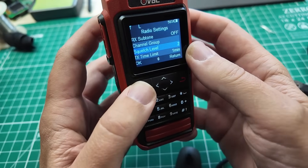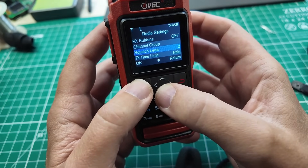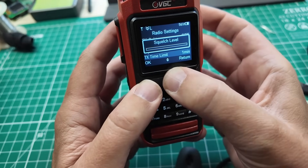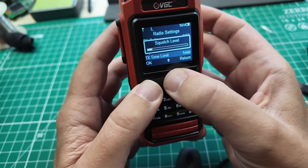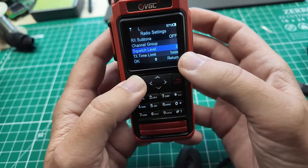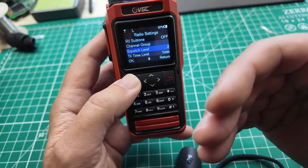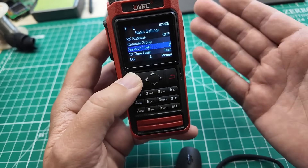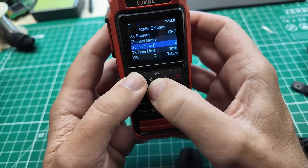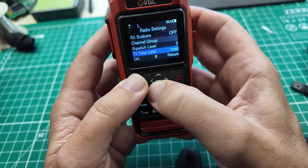Under radio settings, squelch is one of the key settings. I have the squelch currently set to two. If you set it down to zero you're probably going to have the best luck, but then your radio is going to be making all kinds of noise. Setting it at one it'll sometimes chirp in and out, and at two it was okay for the proximity I'm at. But if you're having trouble completing a session, either try again — because that's kind of the way this thing works — or try changing your squelch settings to allow the radio to open its squelch faster for lower signal reception strength.